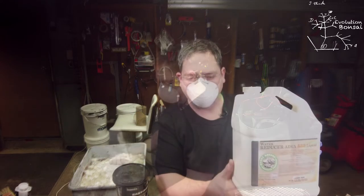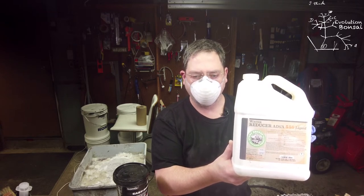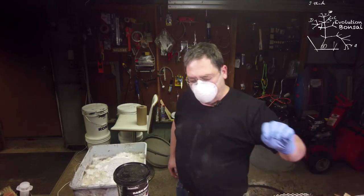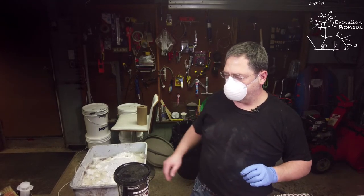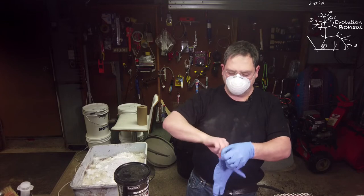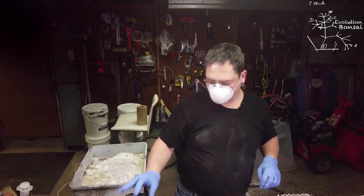The superplasticizer. I'll put a link to it. I use this specific brand just because it's the one I found, but there are many others. They should all work the same. You have to be extremely careful with this product. A few drops change everything. Your mixture may feel dry, but if you add a little too much superplasticizer, it will become fluid like milk, and then you'll have to wait, and it will probably compromise the structural strength of your composition.